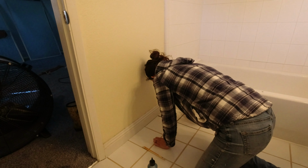The way I did this was I would squirt some of the colorant out of the bottle onto the grout and then paint with some craft brushes that I had. I wasn't too careful to keep the colorant within the lines of the grout because if it got on the tile, it does come off the tile pretty easily so long as you let it dry.